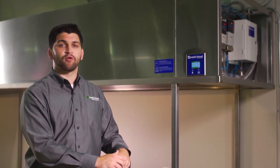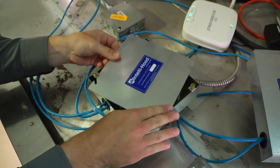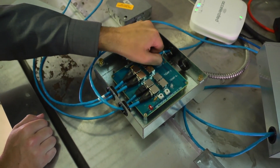If you experience a temp fault, first make sure that the sensors are clean — it's not always necessary unless there is a large amount of grease or buildup. Next, check the connections that go from the temperature probe to the controllers. Also verify the number of temp sensors matches the number of temp sensors programmed.